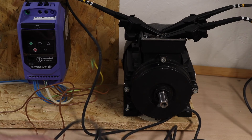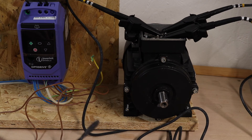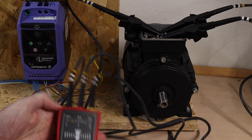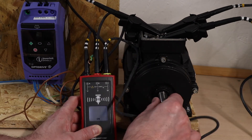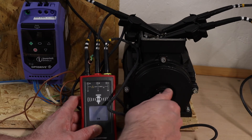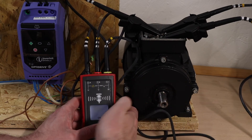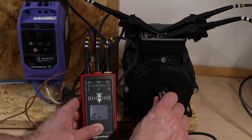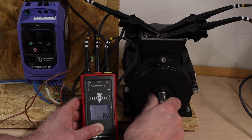Unplugging the Peak meter and plugging in the Amp Probe for the winding test. With the Amp Probe it takes about half a turn to get a reading — not quite as sensitive as the Peak meter — but it works fine and picks up the direction correctly.